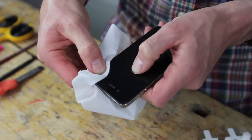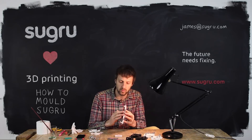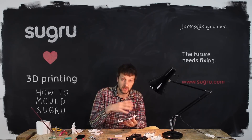Clean the foam, make sure there's no grease or dirt on it, and insert it directly into the mold. The key factor that will determine the quality of your molded part is the quality of fit between the foam and the mold. There's a little bit of play here, so that's going to give us extra flash, but that can be cleaned off later.